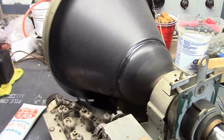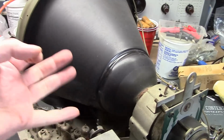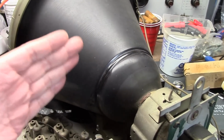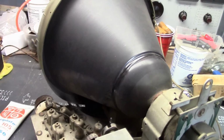The other issue is the glass to metal seal. They did their best to match the coefficients of expansion. They both change slightly with temperature. But in extremes or from vibration, the seal can break and air can leak in, either around here or up around the faceplate.